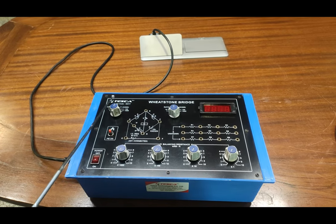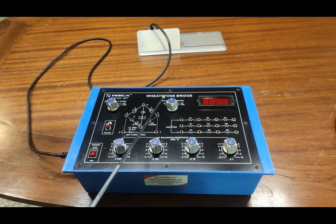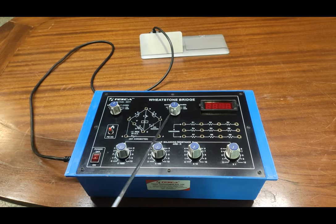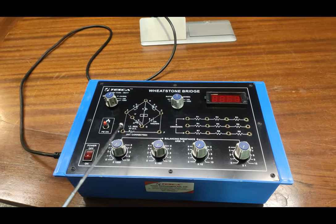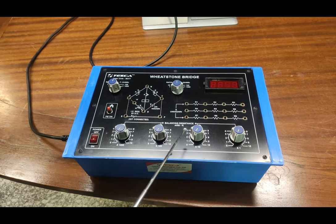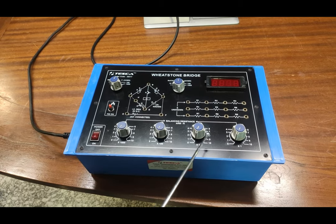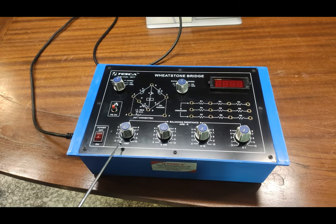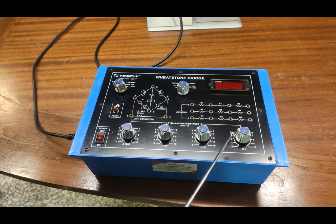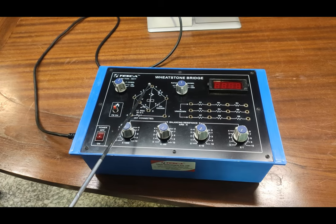The value of four different resistances are selectable with a potentiometric switch. Similarly, the Q arm has 1 ohm, 10 ohm, 100 ohm, and 1000 ohm resistances selectable for both the P and Q arms. After that, this is the balancing resistance — the R arm — which is the main component consisting of different decades: 1 ohm multiples of 10, 10 ohm multiples of 10, 100 ohm multiples of 10, and 1000 ohm multiples of 10. These four decade boxes allow us to provide different resistance values to nullify the galvanometer output. The galvanometer is internally connected to points B and D.